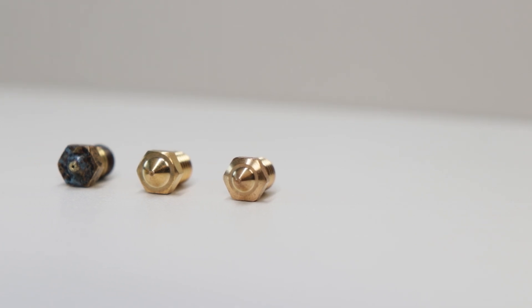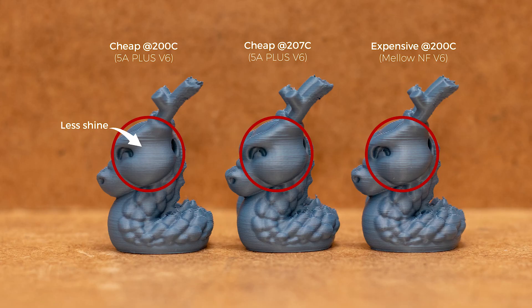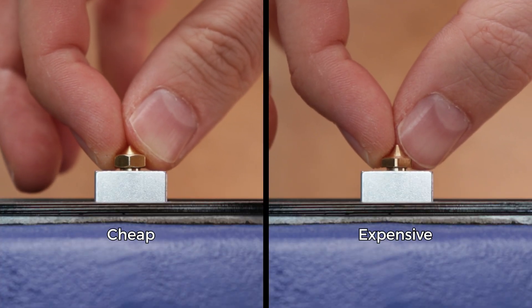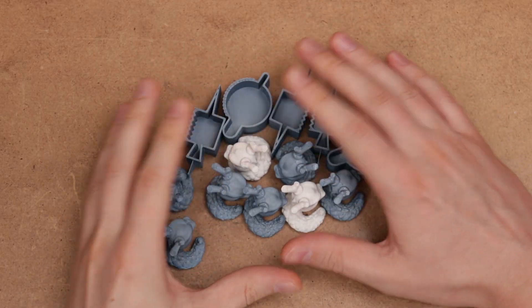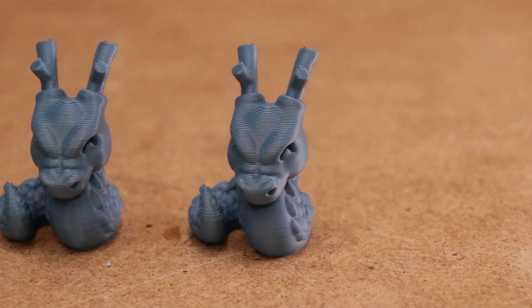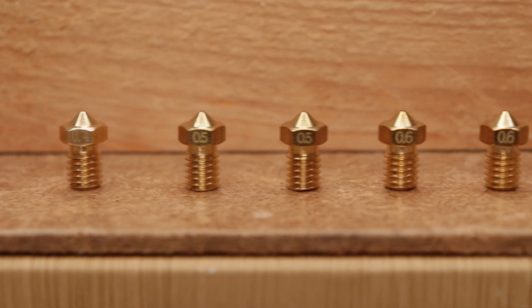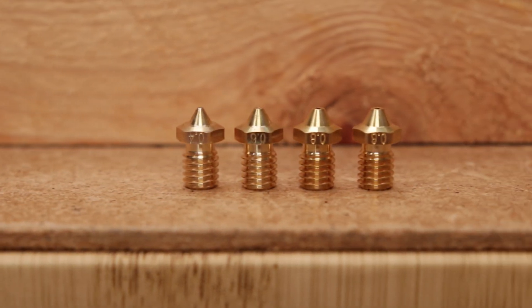So in summary, does this mean that expensive nozzles are overrated? Well, yes and no. As shown, cheap nozzles can have lower thermal conductivity due to lower grade brass and less precise machining tolerances, and that will affect the max speed at which you can print and the longevity of the nozzle. The key point to take away is that you shouldn't expect an expensive nozzle to be a miracle that makes your prints magically better. We basically got identical results despite the insane 10x cost. My only suggestion is to try different size cheap nozzles and when you find the sizes that you like, buy a nice set that will last long.